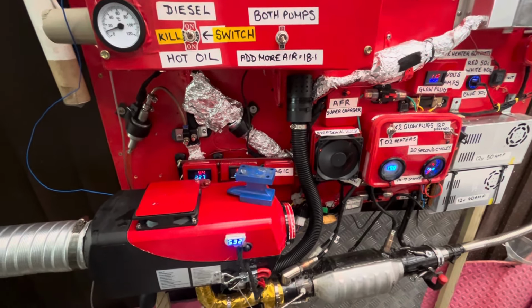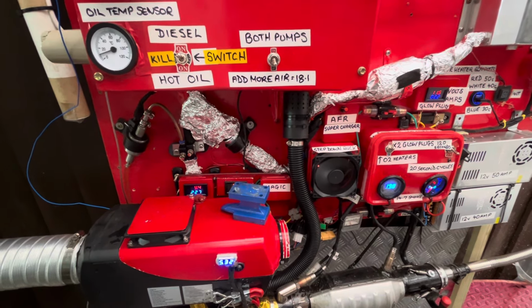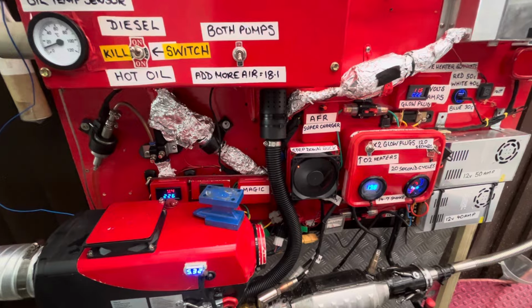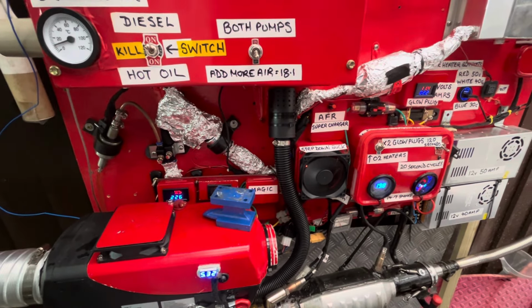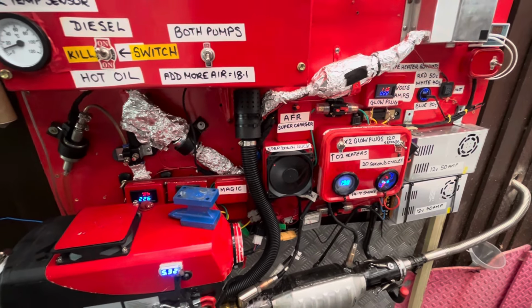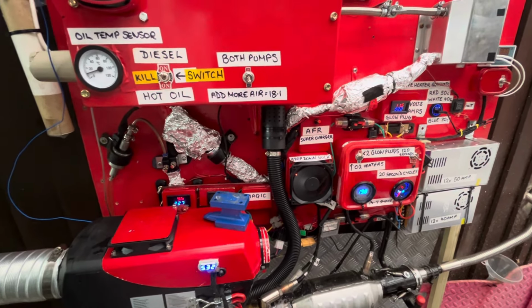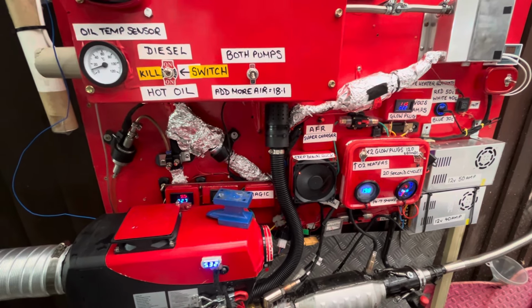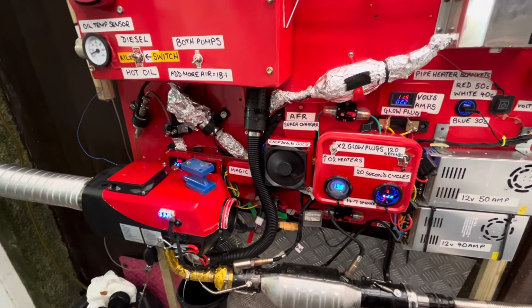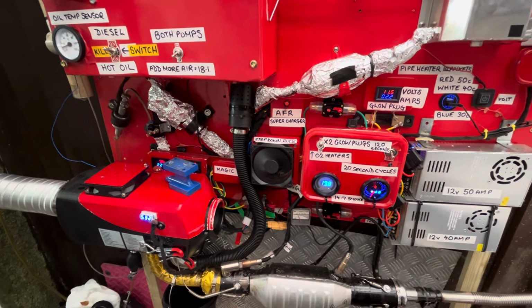If you've ever seen a runaway diesel, a runaway diesel is basically when you've got a really tired engine, and it goes from running normal, injecting diesel, to actually running on its own oil supply from the sump, and it just takes off and revs its nuts off. It's worth looking up on YouTube. You'd be amazed. So you've got really bad piston rings. It will start running on its own oil until it blows itself to bits. Literally blows itself to bits. You can't stop it. There's no way of stopping it other than, if you're brave enough, putting your hand over the air supply and cutting its air supply off. There is no other way.